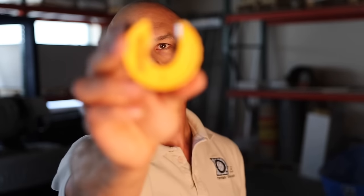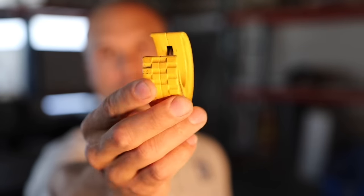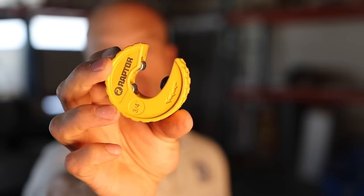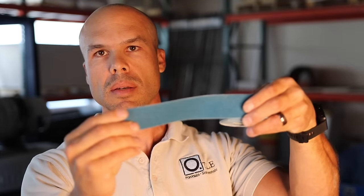So the tools needed. First thing we're going to use is our actual pipe cutter. This little tubing cutter clamps onto the pipe and will cut the pipe off real nice — this type fits in real tight areas in a wall if needed. Second thing we're going to need is emery cloth. It's basically sandpaper that can get wet, and we use it to rough up and clean the edges of the copper before we put the flux on.